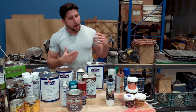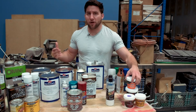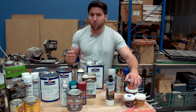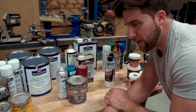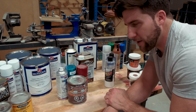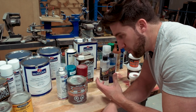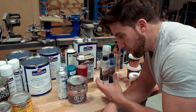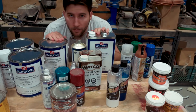Unlike most acrylic lacquers, you can actually tint the Crystallac so that it looks like a proper oil-based or solvent-based lacquer with a little bit of ambering, or you can put it on clear. On the note of water-based and waterborne products, we can also use acrylic paints. These are Auto Air — Auto Air, Wicked — they're kind of the same thing, they're all made by Createx. I'm not really talking about Bob Ross type stuff. What I'm referring to here are automotive-grade paints designed to be used on cars, and then you clear coat them with a catalyzed urethane clear coat and you end up with an automotive-grade finish. These are safer and quite easy to use. When I get custom airbrush job requests, generally speaking, something along these lines is what I use.